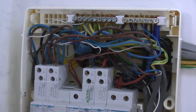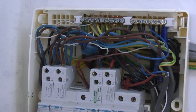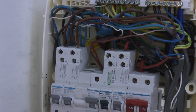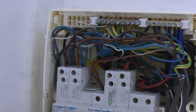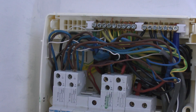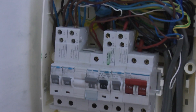The circuit protective conductors — the earth wires — go into the bar at the top centre. The white wires are functional earth connections from the RCBOs, one for each, and although they're tangled and twisted all over the place, they're basically there so the RCBO can sense whether the earth is still connected. Mainly, if there's a fault on the neutral or it becomes disconnected, the RCBO can detect that and disconnect.